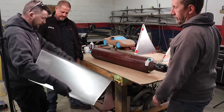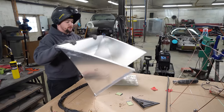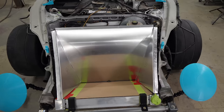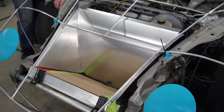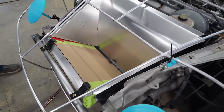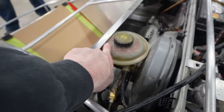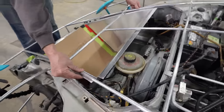That's a lot better actually. We've got a couple tacks on this thing now - the bottom is squared out to the radiator. Before we weld-weld things, you probably should check it - that's always a good idea. A loose rough look at it - it fits pretty well, and it's definitely symmetrical. The one thing that stands out a little bit is the bottom has a small gap. However, we have to figure out how it's going to interface down there anyway, so the gap can be filled. We could have something that comes off the bottom of the radiator mounts to interface with that flange. We need to imagine there's thick foam on top of these flanges going against the bottom of the clamshell, so I think we'll be okay.